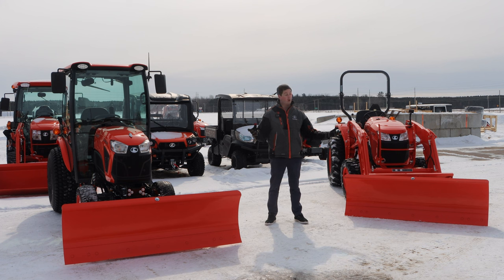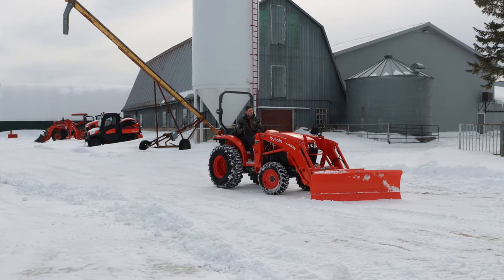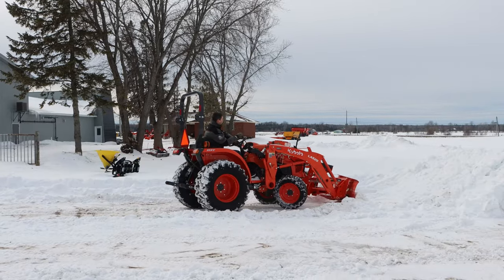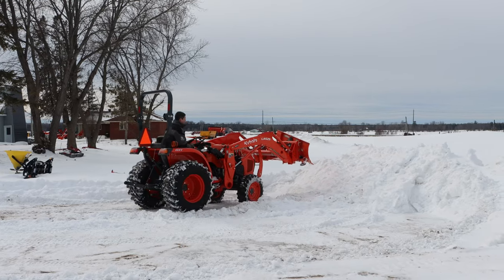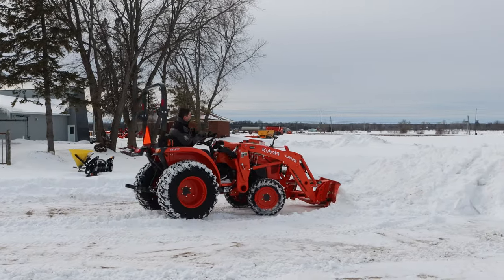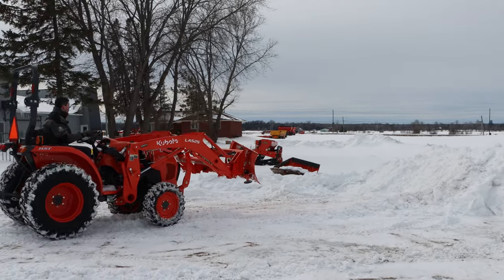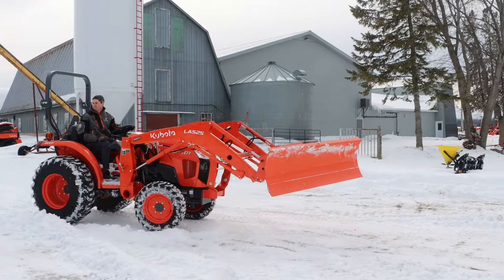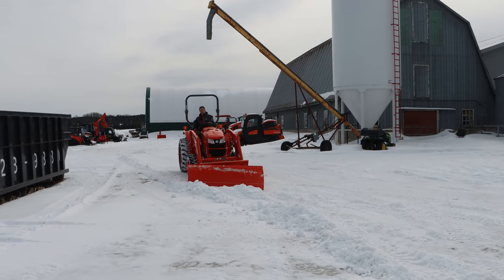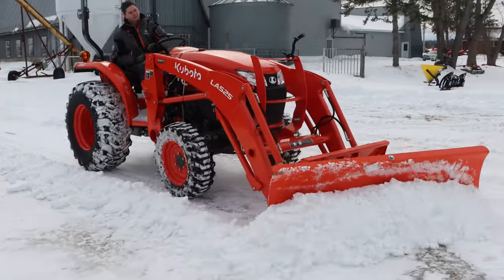One of the benefits of why you may want to go with a loader-mounted blade is for big open areas, because it's going to do a quicker job than a snowblower whenever you get into big areas or nice straight pushes — even up to a kilometer long — where you may just want to push that snow off to the side. Either one will do that beautifully. The nice thing with a loader-mounted blade is you're able to lift that bank right up as high as that loader will go, which is nice when you get into February and start running out of room. It really comes down to the weight of the tractor. You want to make sure you're paired up right with the actual sizing of the blade. Don't oversize it — people wanting to put a 72-inch on the front of a BX works great if you've got five, maybe up to 10 centimeters, but after that it's going to lose traction and bog down, especially with heavy wet snow. Sizing is getting really easy to do on the STP lineup.